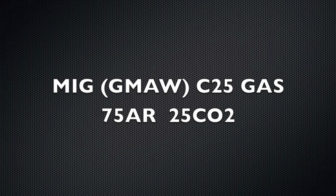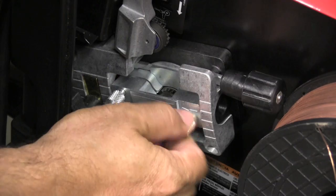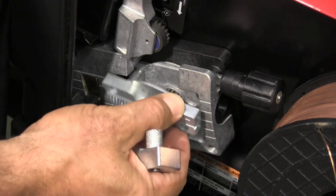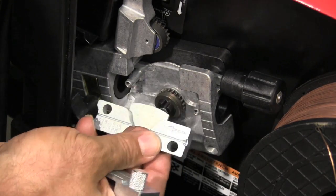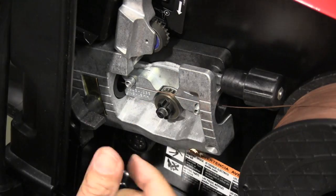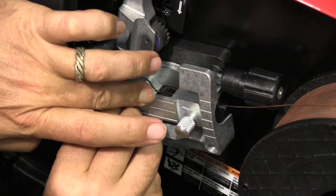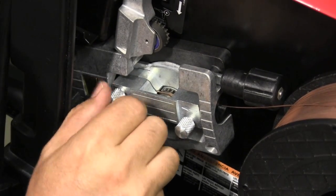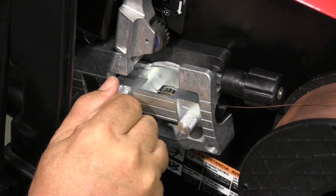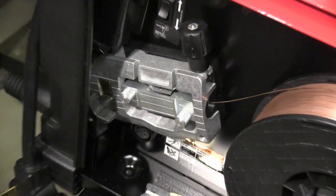Let's take a look at MIG welding now with C25 gas — that's 75/25 argon/CO2 gas. One thing I want to point out is this little block on the wire feeding mechanism of the cast aluminum housing. It's got these little guide blocks with a little groove in there for the wire, and what they're for is to prevent bird nesting. Basically, when you feed the wire through, you feed it through those little grooves and then clamp the other block on there — chances of any bird nest are slim to none. The Power MIG 350 MP that I have has this also, and you use a nylon one for aluminum feeding because it's smoother.